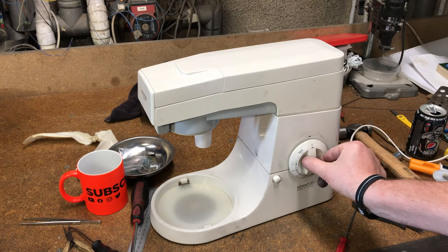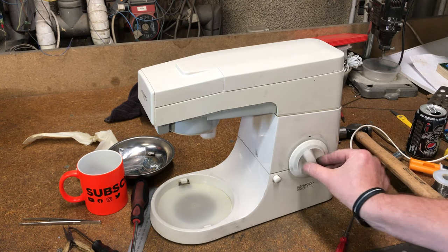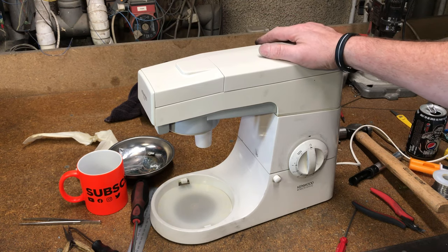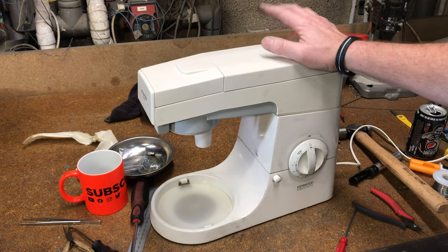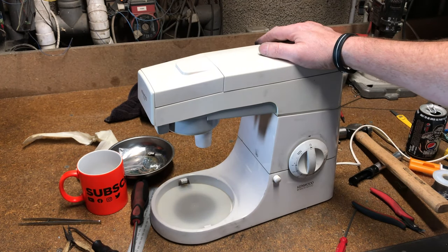Well, it seems a success! The parts for this were only 14 pounds, which included the brushes — there are different levels you can get from eBay, just the brushes, just the feet, etc. That 14 pound bag gave me the triac, a resistor, a couple of caps, and the brushes. I only fitted the caps as those are the ones that blew up. I'll hand the mixer back to the wife, let her do a bit of cooking trial for a few weeks, and if it's all good, great — if not I'll have to revisit. But it's all looking good. Please give me a thumbs up if you found the video useful and informative — it gives me that little boost to go ahead and do a few other videos. Thanks for watching.